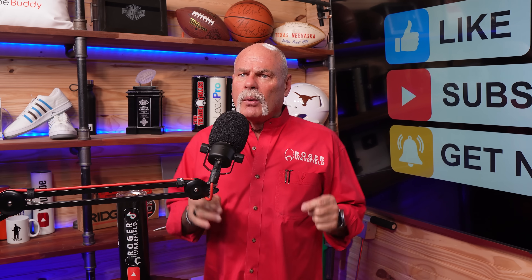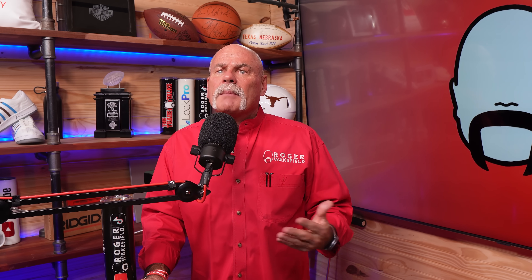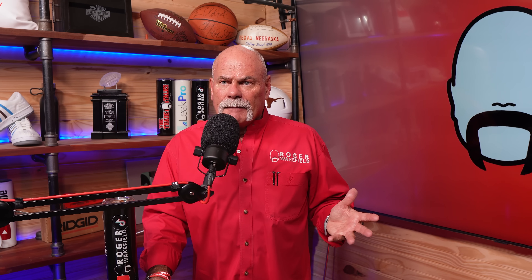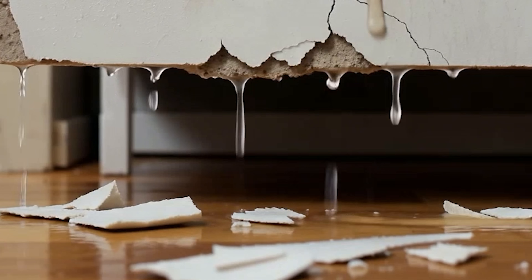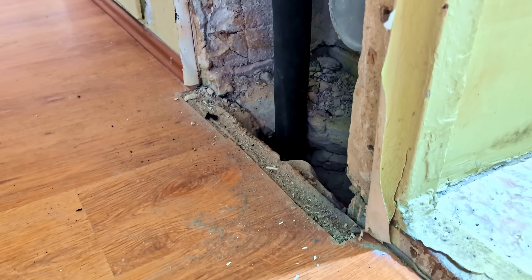This is a step that amateurs always skip. But here's the real reason most professional plumbers hate them: you can't use them behind a wall, period. Reputable plumbers will never install a push fitting in an inaccessible location, like inside a wall, in a ceiling, or buried underground. Because while a properly soldered joint is permanent, a SharkBite relies on that single rubber O-ring. If it ever fails behind drywall, the damage will be catastrophic before you ever know it's there.